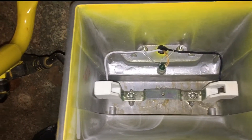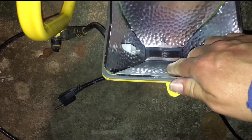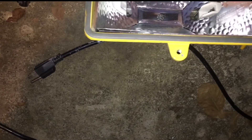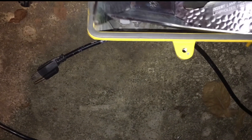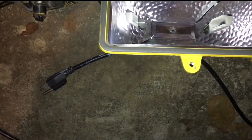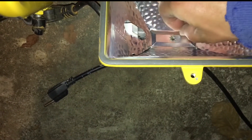Now that you have the socket installed, you're good with the power as long as you close that box up. Now we're going to put this reflective heat shield back in here. This is the thing that pushes the light out and keeps the wires and stuff from burning up, because these things do get pretty hot — that is why it burned up in the first place. Probably wasn't making a good connection, wasn't grounding properly, and it fried the one end. All you've got to do is put one screw down in the center.